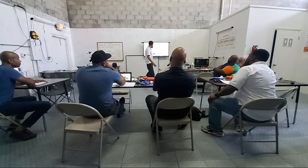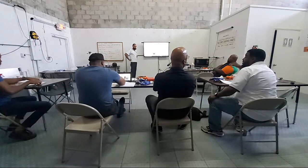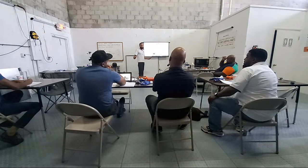When I'm talking to Tuesday, I always thought that, let's say you go from one side to the other, say, for example, you want to just do the low side. I've never actually run nitrogen through the compressor, for instance. Yeah, all the time. Yeah, 120. And that wouldn't mess up the oil, or none of the Freon is in there? There's no Freon in it because we've evacuated it at this point. Oh, okay. Remember, we checked it for a restriction.